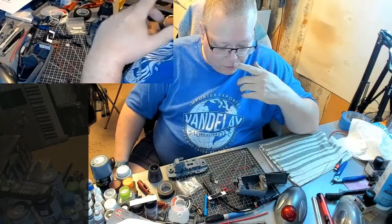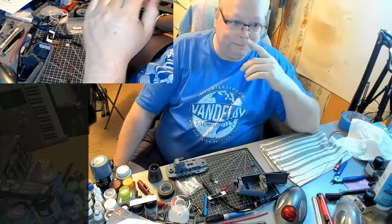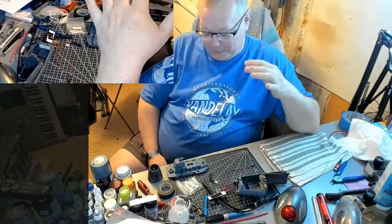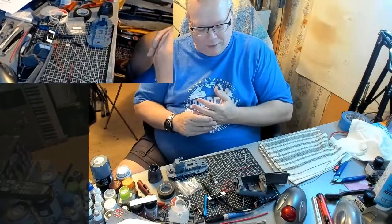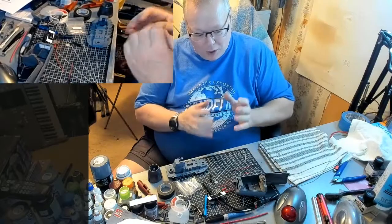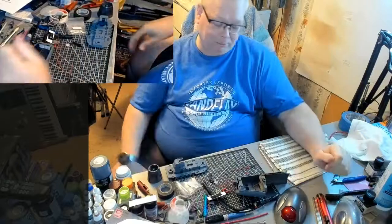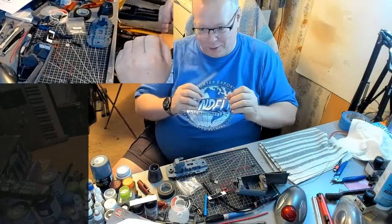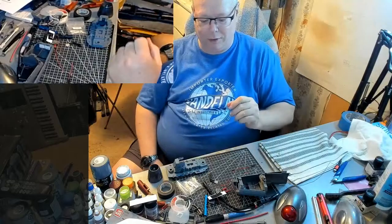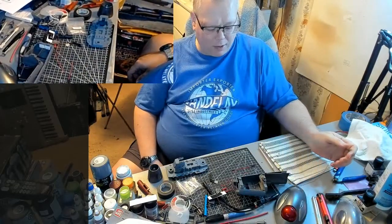I made the mistake of trying to hook up LED lights directly to 12 volt power. That was a mistake, because I had no way of testing if my wiring was correct, other than hooking them up to power. And so I hooked them up, and they would light up, gone. They'd go on, off, and that was it. Which made me think, what the heck have I done?